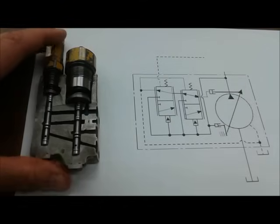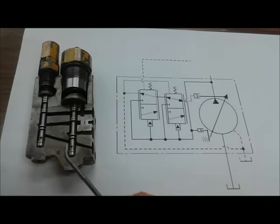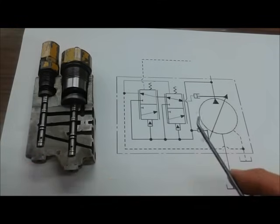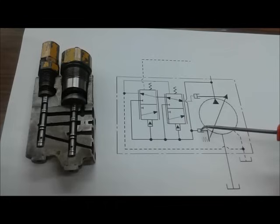So just looking at this load sensing pressure limiting compensator, I just want to compare the actual parts to the schematic here first of all, and then I'll go through how we would color this to reflect what's going on in standby condition. So again, the pump is here. We've got a bias spring and bias piston, which are going to be responsible for trying to upstroke the pump